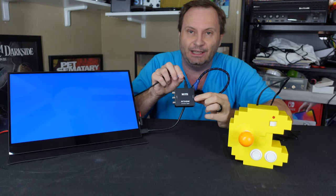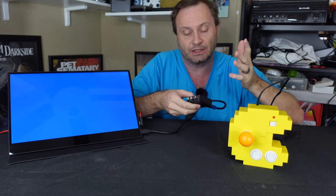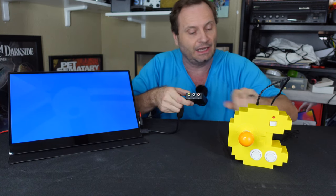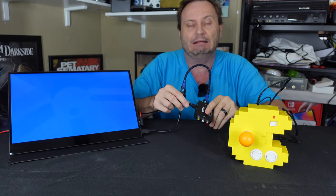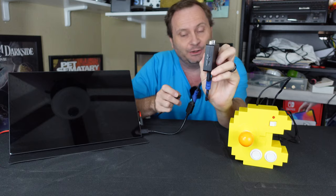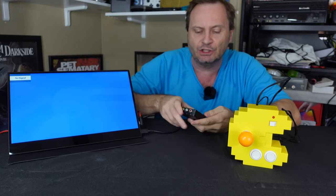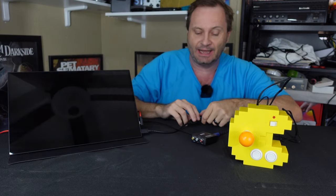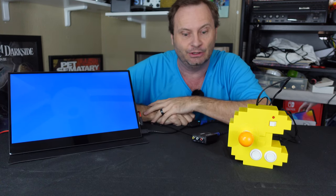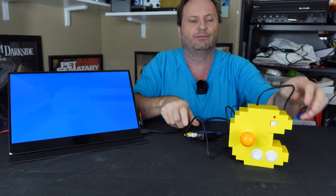I've got my little portable HDMI monitor here, but this is not HDMI, so we're going to need an AV-to-HDMI box — I'll have links to that via Amazon affiliates. What I have is an AV-to-HDMI box that takes standard composite RCA input, exactly what we have here. It's powered by USB — unfortunately a mini USB, not micro USB or USB-C, which I had to dig to find a cable for. It has HDMI out, and I've taken that to the mini HDMI on my portable monitor.